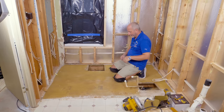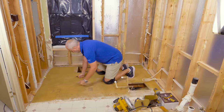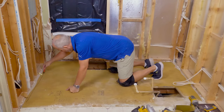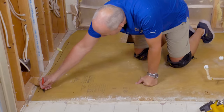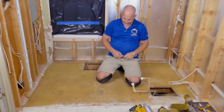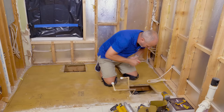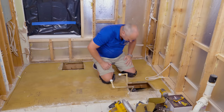That's nice and solid still — amazing — but up against the outside of the house there are soft spots. What I'm going to do is cut back here along this staple line and chalk line, which represents the middle of a joist. I'll cut about an inch and a quarter away from that, exposing part of the joist, and then laminate another piece of lumber there to integrate the new subfloor. The plumbing is coming from this direction, doing a 90 on a weird angle into a spaghetti contraption — not a big fan.